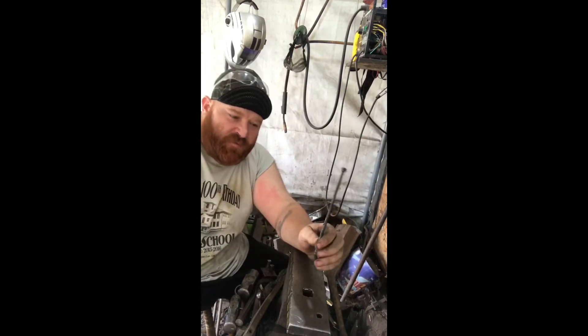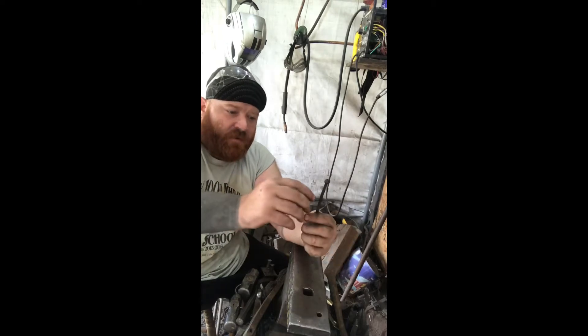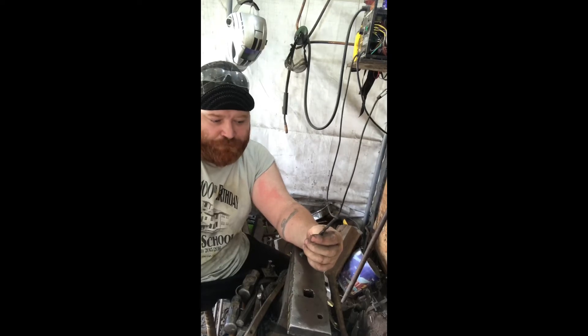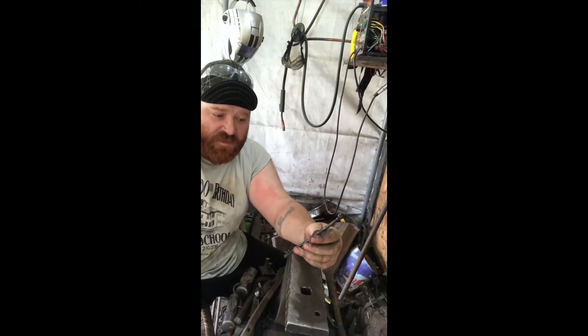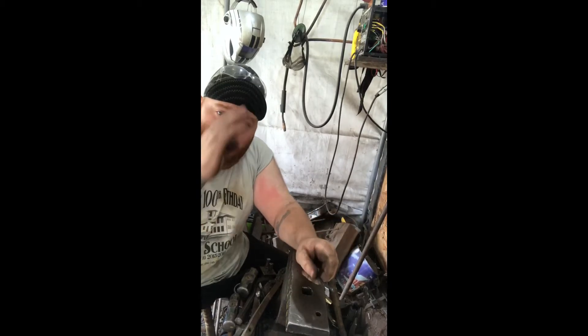Okay, so we've got our twist in there. Now we're just going to go straighten it out — get it all straightened out. We're going to do some more collars down here with the twist where the grooves end, and then we're going to straighten it out and bend it into a bracelet form. I'm going to be collaring up here, a few more collars, and we'll be pretty much done. We just got to heat it up, do some finish work on it, and call it good — see you on the other side.